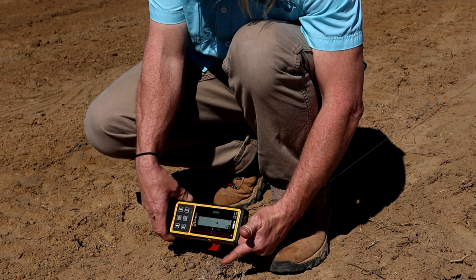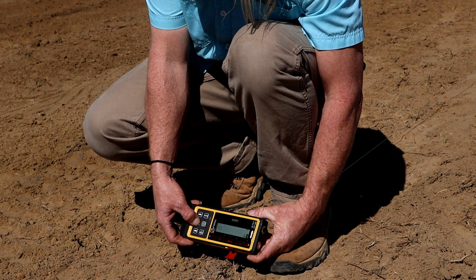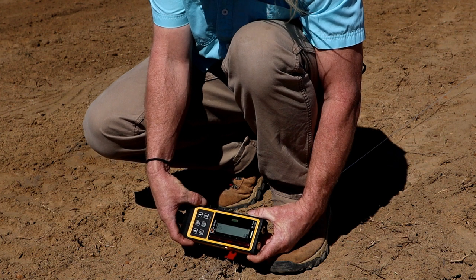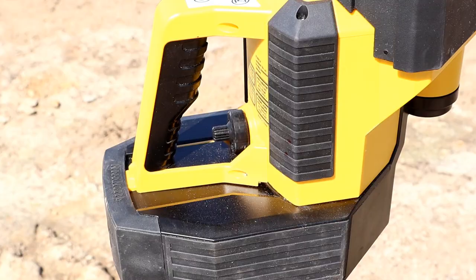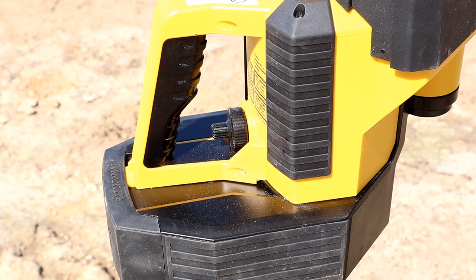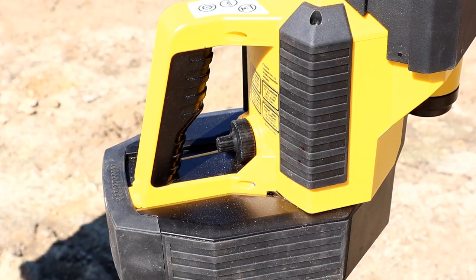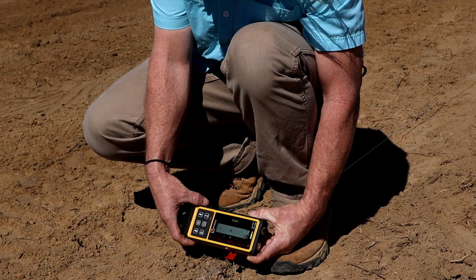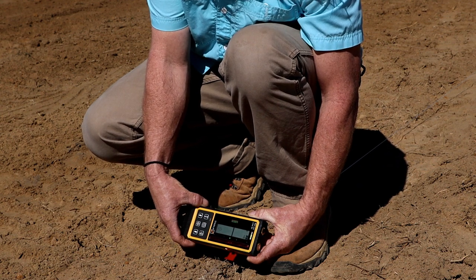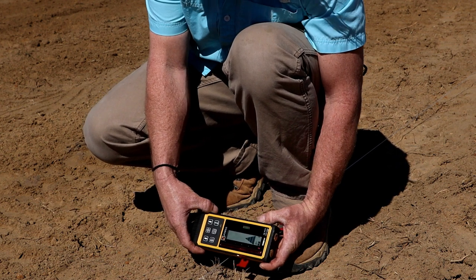Alright. So it's showing my laser, my string is here. It's showing it off. So I'm gonna set it up. I'm gonna hold these crosshairs down until this blinks three times. Now the laser will start moving. Now it's just checking itself. And let that blink twice. Just self-check it. See, you heard that? That double beat. Now we're on. See if I get out here.